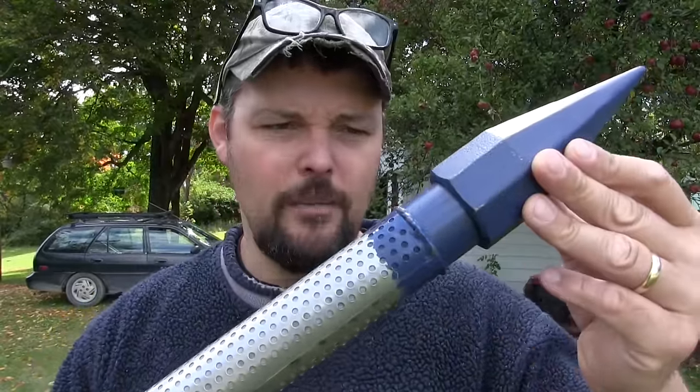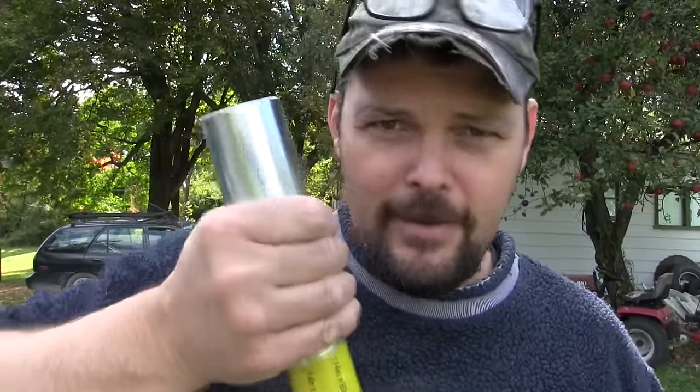It's not going to freeze that far underground until the middle of winter, and at that point you're probably not going to be using a hand pump anyway. Another question I got quite a bit: can you pull the well back out? If you drive a well down and hit a big rock, yes you can pull it out — pull it as straight as you possibly can. Once you first put a well down you can still turn the whole well by hand, and the fact that the point is bigger than the pipe diameter leaves a little wiggle room, so you'd probably be able to pull it out, maybe with a tripod and pulley to get the right force straight up. But once you hit water and the well's been in for a year or a year and a half, it's quite a lot more difficult — all the ground has settled in around the point and couplings, and it's going to be very hard to get the pipe back out.